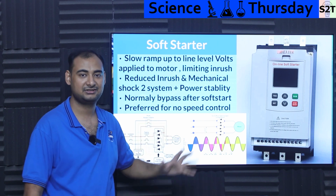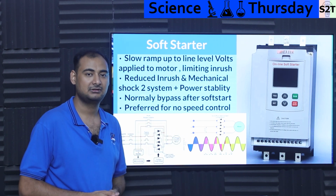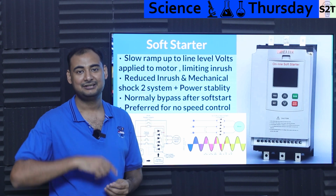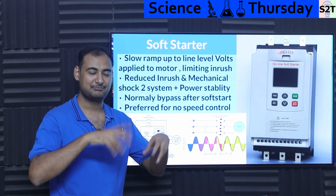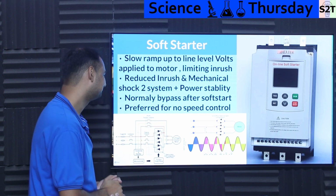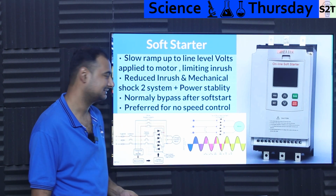Like there is no scenario where I'm running a 10 megawatt induction motor and people are like, bro, put a goddamn soft starter on it. Or back in the old days when we did not have soft starters, we literally had a smaller motor that turned the main motor slowly, so the back EMF would generate far more quickly. That was the simplest way to tame the inrush current. It does not work that well, but if you had nothing else, that was the only option.